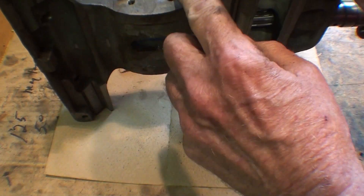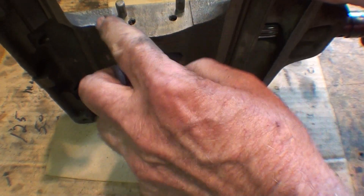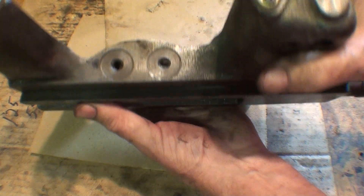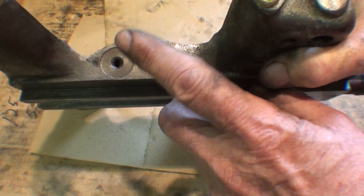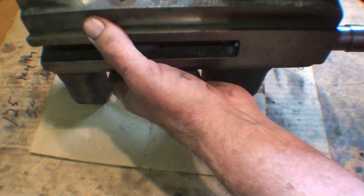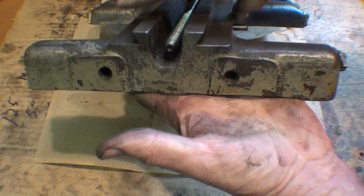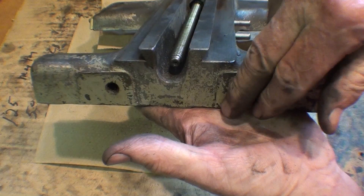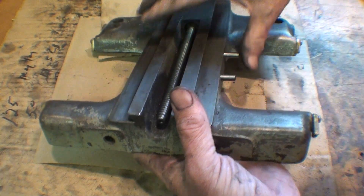These two pins — I'm not sure what those are for; those might have been put in at a shop somewhere. Looking at this side, those two holes have been spot-faced as well, and that holds the travel rest. And back here on the back, there are two holes and two machined surfaces that have been painted and shouldn't have been painted — those would hold the taper attachment.